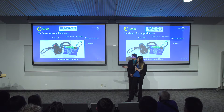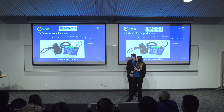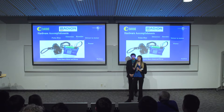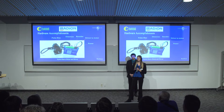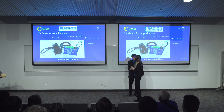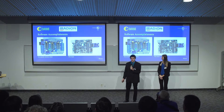The hybrid servo will be controlled like a stepper but operates like a servo, because there is an encoder inside the motor that keeps track of its position. This is the compatible driver, and it will accept the pulse size, direction of turn, and encoder instructions from the microcontroller. The black ports are for powering the driver and sending instructions from the driver to the motor. For our project, we have been using an Arduino microcontroller, which allows us to control a single motor while conducting tests. We used the Arduino IDE to create test code for each of the motors to see their limits and functionalities to best decide which motor to use.